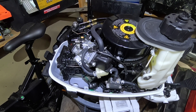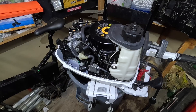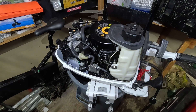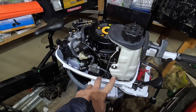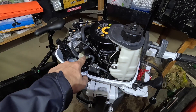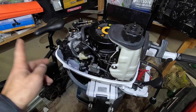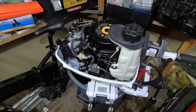I realized I actually used 87 octane gasoline, and Tohatsu recommends 89 at least. When I realized my fuel system might have clogged up from cheap gasoline, I bought some Sea Foam, added it to the internal tank, filled up with gas, and just ran it dry. The additive might dislodge any gasoline byproduct that accumulated in a filter or in the lines, but it will still get stuck in the filter or possibly in the carburetor. So I decided to run it through the system before removing and cleaning my carburetor and changing my gasoline filter.